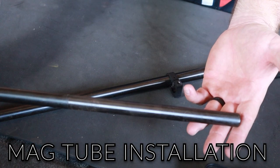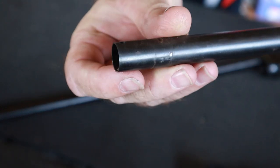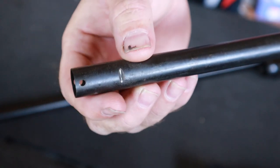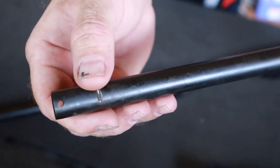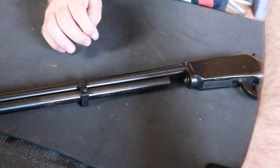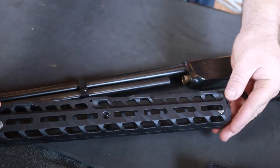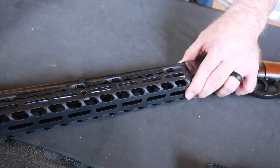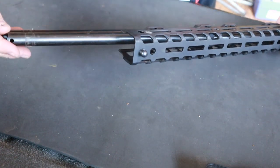We've got our mag tube in hand — but which end is which and which way is up? The holes in the end are going to be your muzzle end. Your little hole goes up in correspondence with the groove that's cut right there — these crude little grooves worked for lots of years and this is going to point toward your barrel. Slide this through and then stop. Now take your magazine follower and poke it in the receiver, then take your Costa hand guard and set this right here, clocked and sitting meticulously. Let's get this into the end of the receiver, then take our mag tube and slide it in. Rotate everything to where it lines up — beautimus.